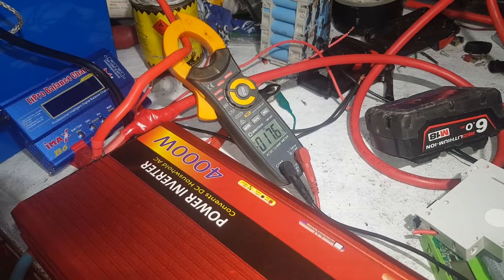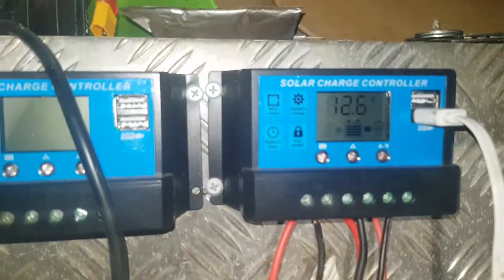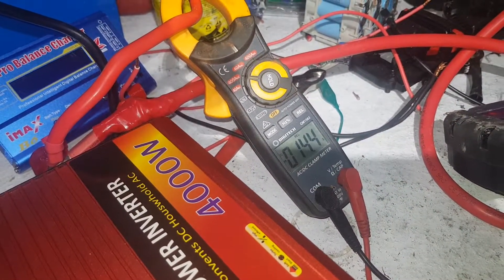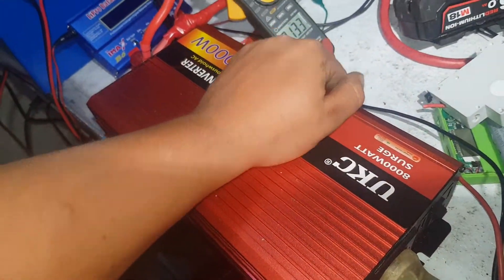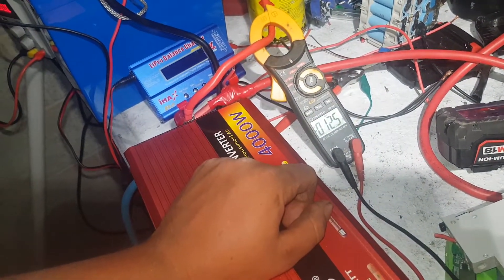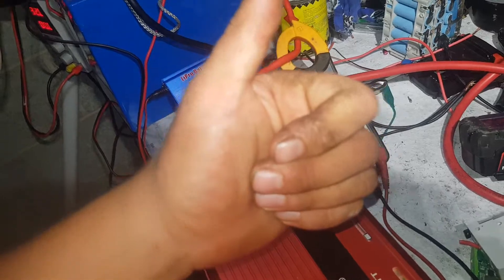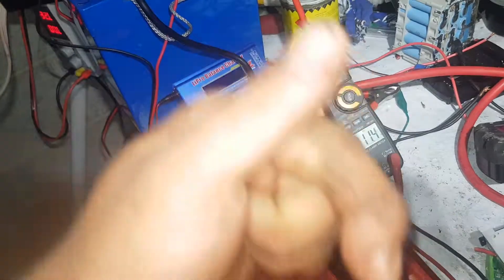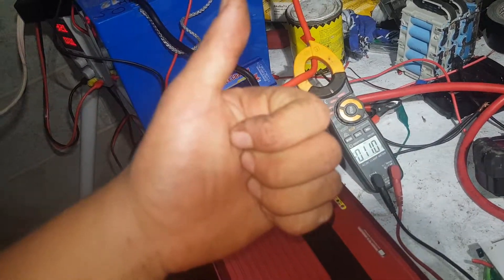Still 18 amps changing hands, 17. Voltage is equalising, still going back up to 12.6. There you go - if anyone wanted to know what kind of current you're using at about 1600 watts, 125 amps is coming out of my battery pack. Current clamps certainly helped out with that. Thanks heaps for watching guys, catch you in the next video. Subscribe button, other video button, links for anything I feature in the video description. Give us a thumbs up - I'm giving you one.